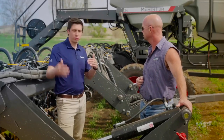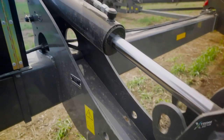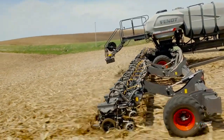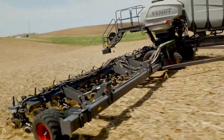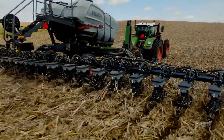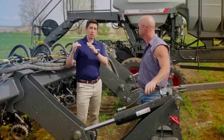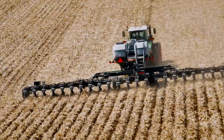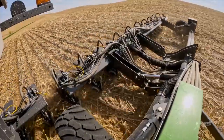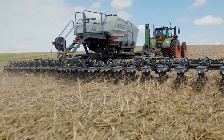So you've got three independent 20-foot toolbars. This is the leveling system — like almost everything with the planter, it's automatic and self-adjusting. Throughout each wing, three potentiometers read the height of the row units. We get the lowest row unit and the highest one, and we place the toolbar right in the middle automatically. With the travel in the parallel arms, if it's in the middle, everything should be appropriate. We go eight inches up and eight inches down — that's two inches more than every other planter. The parallel arms are longer, giving a lot more travel. If we have vertical travel range, we can help farmers maintain consistent depth and the ultimate goal: even emergence.